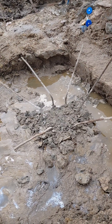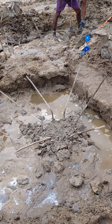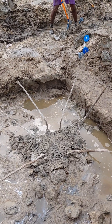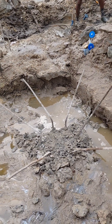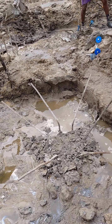This is the head of the pile — from here the test will be carried out and you will now get to the tube. We don't yet know the depth of this pile, so from the Pile Integrity Test we need to determine the length of the pile. It also tells us whether the pile is uniform and free of any intrusion of foreign matter like sand and other debris.